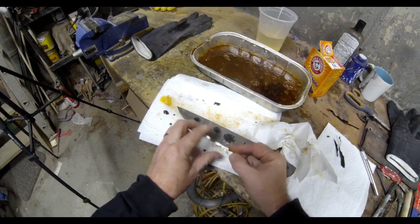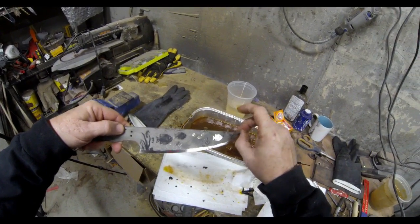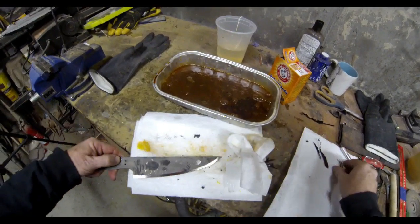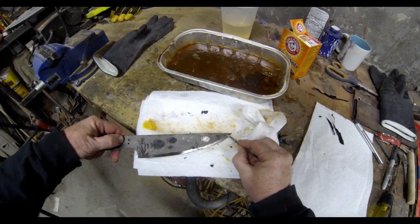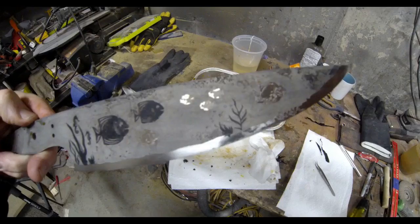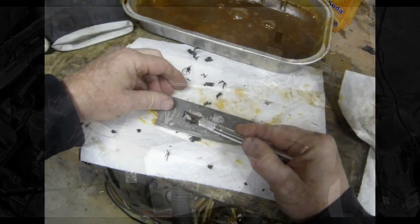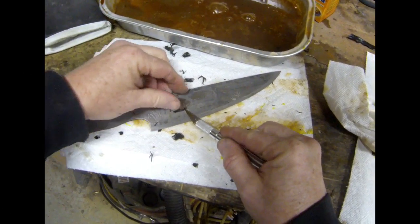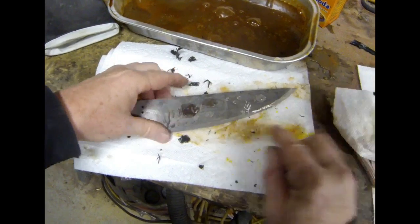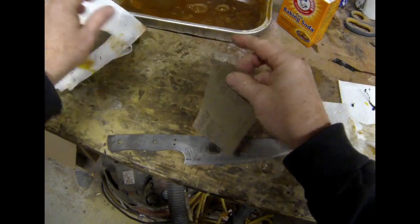Then I take the knife out and remove the remaining vinyl, including the vinyl that covered the actual micro bevel. At this point I realized I didn't want the sandy bevel area at the bottom or the remaining fish to be shiny, so one more time I removed all of the vinyl from the blade and went back into the acid etch for another 15 to 20 minutes.